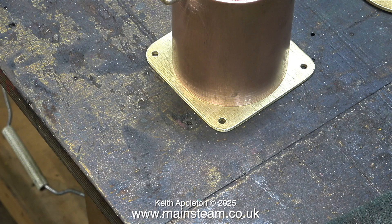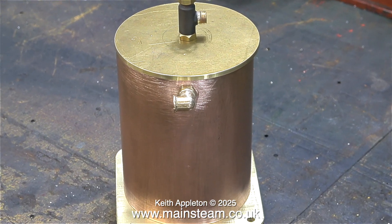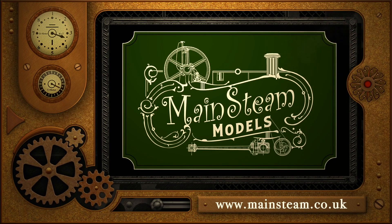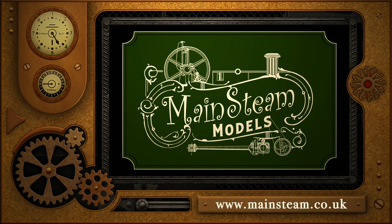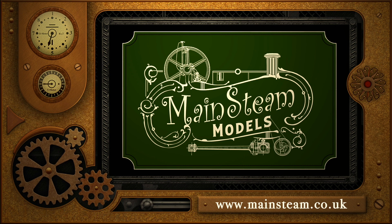Using my four inch belt sander I scratched the top surface of this piece of metal because it's going to be painted. Here it is - it's the base. This clip gives you some idea how the condenser is going to look when it's finished, but it still needs another hole drilling at the top at the right hand side, 90 degrees to the inlet. And that's it for this episode - stay safe, stay healthy, thanks for watching and I hope you found it useful. Please take the time to visit my main steam models website and click on the section that says video playlists, where you can find other videos you may like to watch back to back.